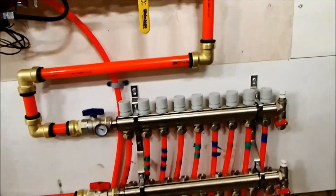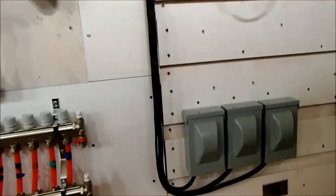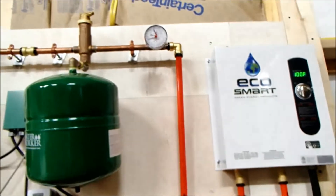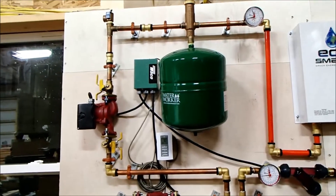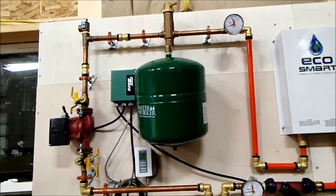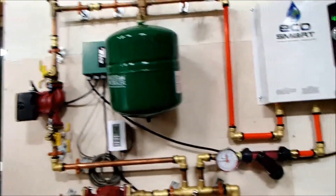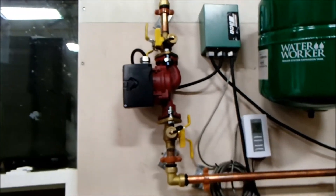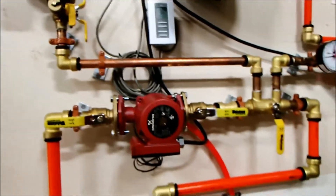All of these parts I purchased from Menards, except the boiler came from Amazon, the pumps came from eBay, and Blue Ridge Company sold me the pole barn kit for the PEX and manifolds. Even the wiring and disconnects came from Menards. This is essentially a copy of the HydroShark integrator panel that I read about online — I just built it myself, because buying the individual parts saves you quite a bit. If you're a little handy and can make some fittings, you can get much nicer pumps than what comes with their small low-temperature integrator panel.